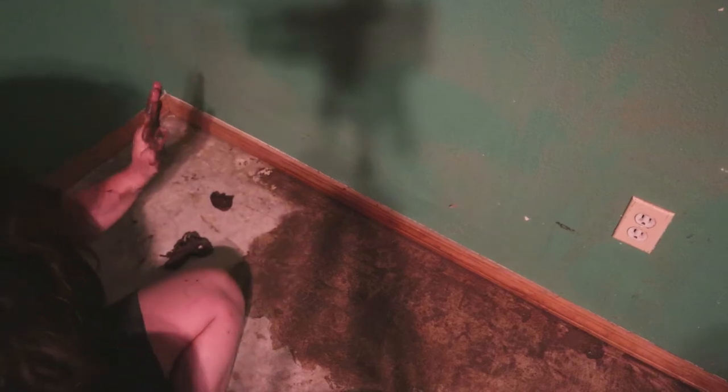You rub it in and then you pat it. Like so. And that's all you do the whole way around. And then when you're doing the edges, you push it under. Push it under. And then you have a clean rag to wipe your stain off your baseboards. You just keep on repeating that. Rub and pat, rub and pat.